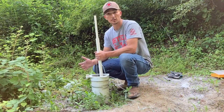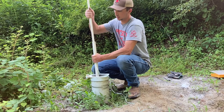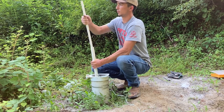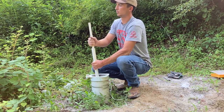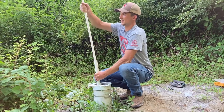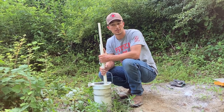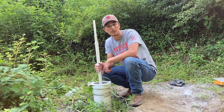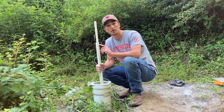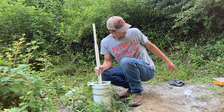Now that it's in, the next thing you need to do is ensure everything's working properly, so you're going to actually pump it a little bit and see if it pumps. It's getting happier. Now before I forget, we need to drill the weep hole about 5 to 10 feet down so it can weep out and not freeze over if you have to use it in cold weather, and then we'll attach the cap.